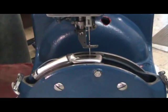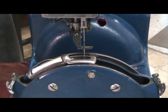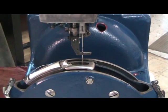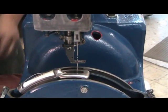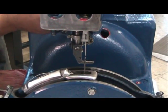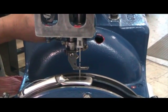That covers the proper adjustment of the needle and awl alignment on the Campbell Lockstitch. Always verify that your needle is in proper position first, and that neither your needle nor awl are bent. Make sure there's no wear on your machine that could be causing the problem. Once you set this, unless you put the machine in a serious bind or knock the head out of alignment during moving, there should be no reason to have to set this again.